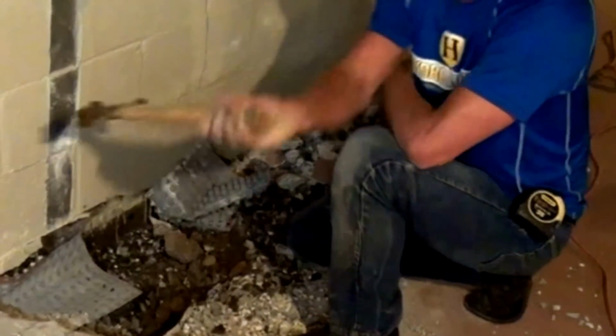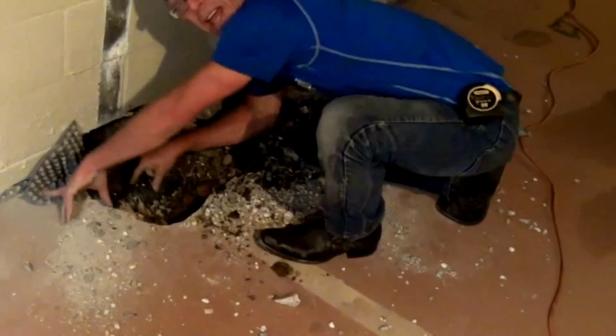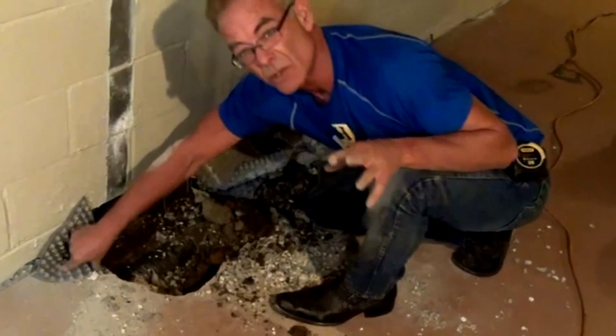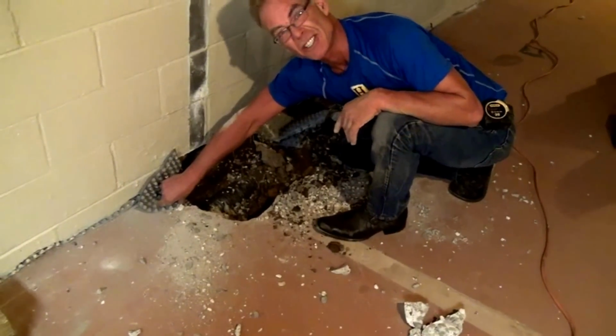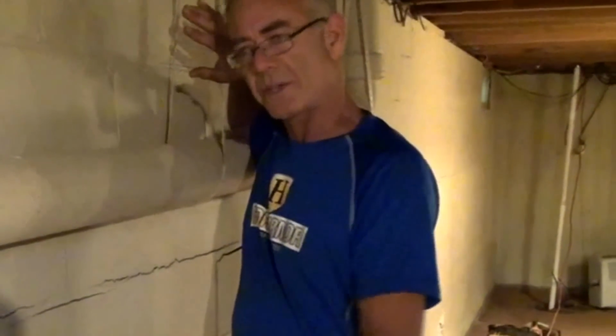This is dirt, not stone. They just dug a little trench and put this pipe in here. And the pipe is 3-inch ADS. Salesmen will usually show you 4-inch ADS. Looks like the same, but it's not. It's cheaper. When you get your estimates for a pressure relief system, and you decide maybe you want to save $2,000 or $3,000, this is a $27,000 repair job now that could have been prevented when the system was originally done.